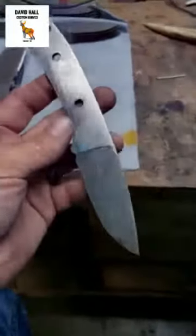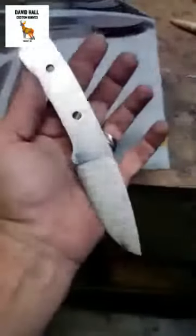Here we are off an 80 grit on what we just turned into a flat grind. I'll chase that down to 120, do the flats, and it's ready to go — less than 10 minutes to go from a hollow grind to a flat grind on a little over eighth-inch thick stainless steel. Hope you enjoyed the video. Leave a comment — has anybody else tried this and what do you think? Hope you guys have a good day.